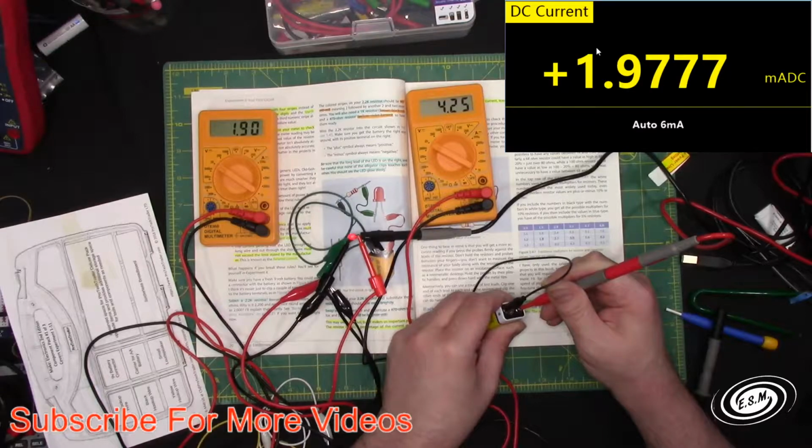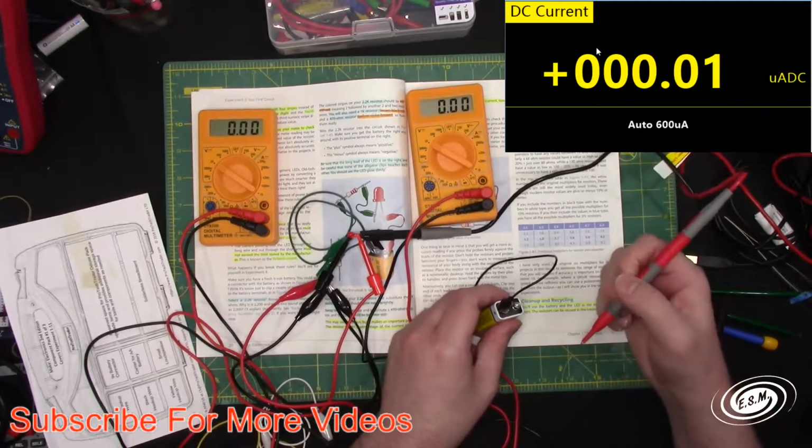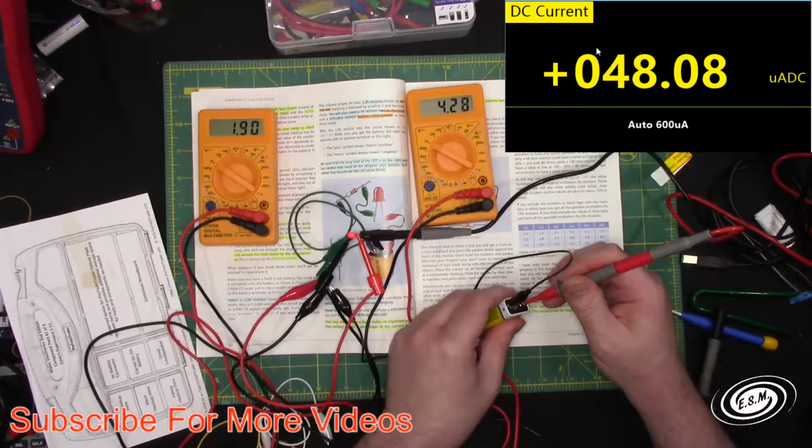Yeah, because we don't add up to 9 volts. Volts in is supposed to equal volts out, and we don't really have that on our drops, so there must be drops across the wires. Could be these cheapo meters. Who knows? So now, if I was to check the current anywhere other in the circuit, it would still be the 2 milliamps. So there's that alarm. So it would still be the 2 milliamps.